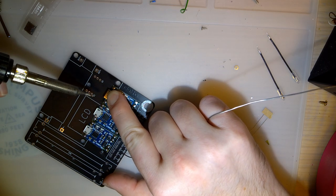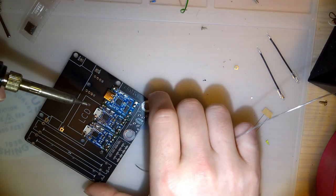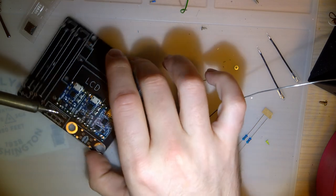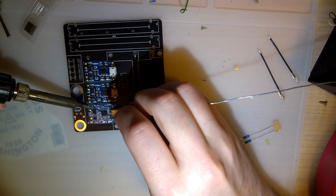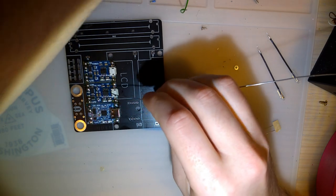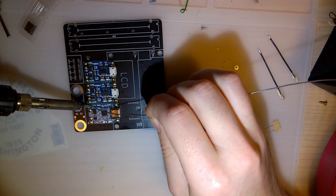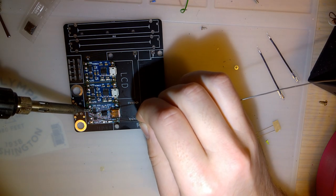For what it's worth, though, if you're building one of these, I recommend the micro USB modules, because the USB-C ones are through-hole, so they have a little bit of a protuberance on the bottom. It just means that you can make the micro ones flatter than the USB-C ones. So, potentially easier to solder. Though functionally they are identical, so it really does not matter.